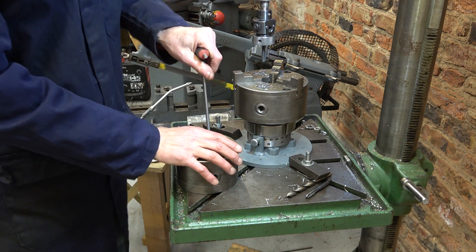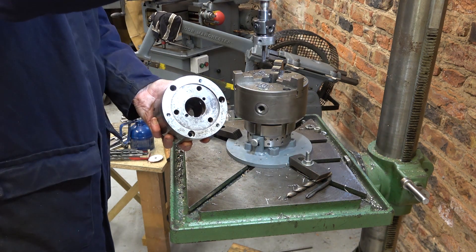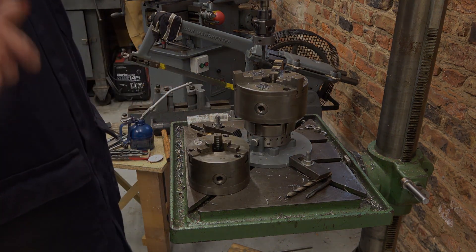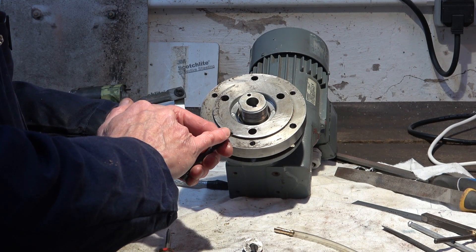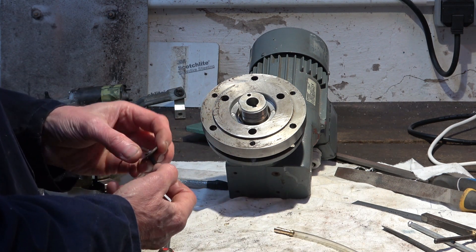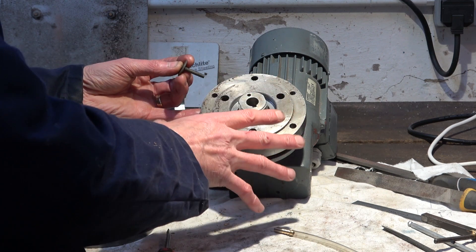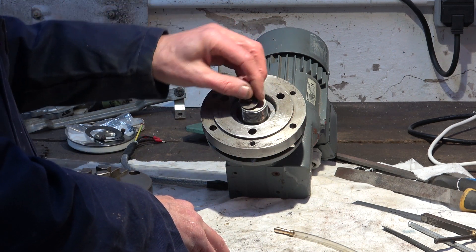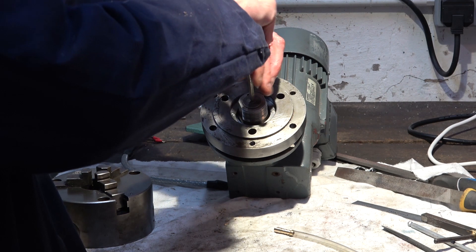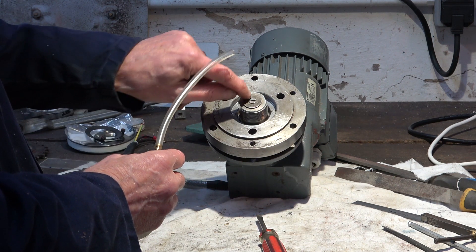I must get a new lamp — the batteries are kaput in this one. I just need to take a fraction off the length of those screws. I've ground about a millimetre off the ends to finish those off. Now I want to look at securing this — it's held on with a grub screw on the key, but really that's not enough; the chuck's a bit heavy and I don't want it on my toes. There is a centre screw thread in there, so I can put this in with a washer and a bit of Loctite on it. It's covering that hole up a little bit — the gas port, let's call it — so I'll just file the washer to suit.